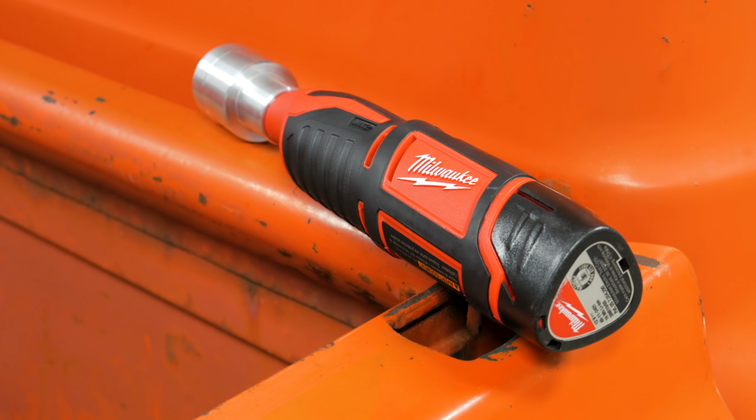There's one optional thing when it comes to this. You can get it with a slot to cut tungsten. That cutter slot allows you to go ahead and cut down tungsten when you get it really globbed up, when it's really contaminated, and you can't fit it through the guide holes anymore.